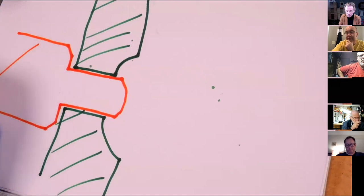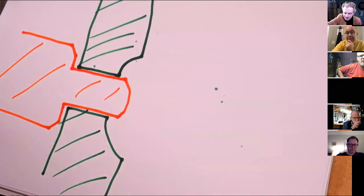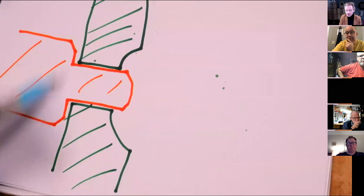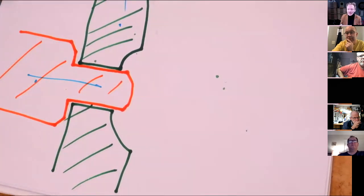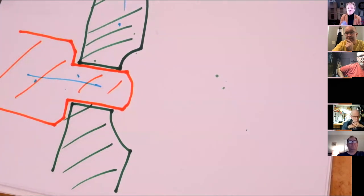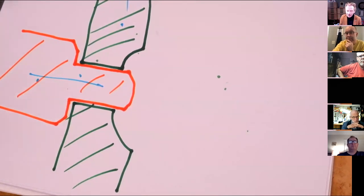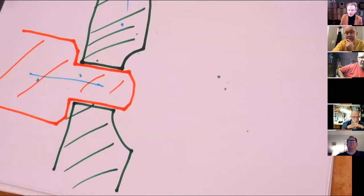Okay, so despite the rather random color coding here, in most cases you've got a steel axle. So this is steel, bad color coding, sorry, running in a brass frame, bad color coding again. Okay, so this rotates within this. This is called a bearing, probably the simplest kind of bearing you can get, because there are no other rotating elements like in a machine bearing or something. And like most bearings, the vast majority we see in horology, unless you're working on Harrison clocks with lignum vitae, you need added lubrication.